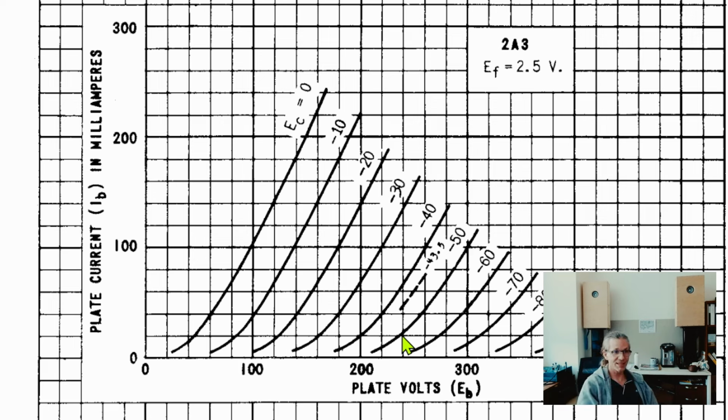But now you can see the problem here is that to have plus 70 and minus 70, we need to have at least 70 milliamps quiescent current, but we had only 65. So this results in that when we go up, we can go up plus 70, but when we went down, we could drop only 65 minus 50, which is, what was that? 55 or what was that?